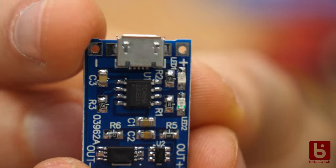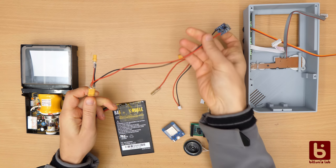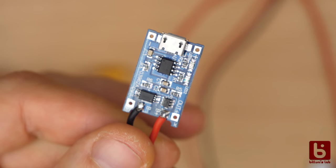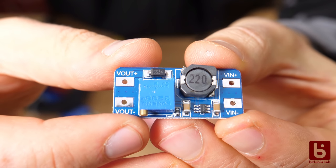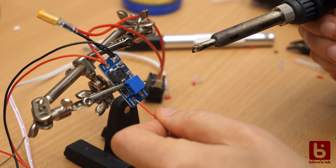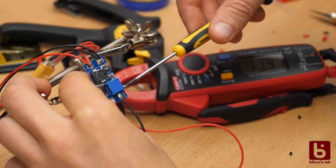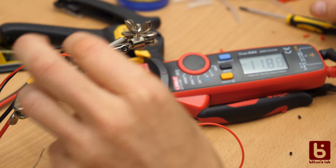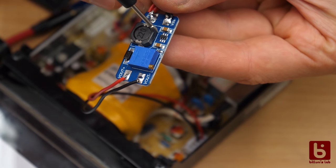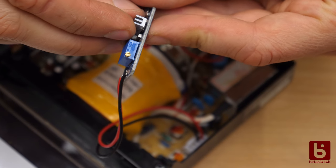A new addition is this off-the-shelf charging circuit. It's connected to the battery directly and is able to charge it with 1 amp from USB. To get the 12 volts for the CRT I have used a step-up converter. It has to manage at least 2 amps since we have to step up from 3.7 volts to around 12. Even though the seller stated 3 amps, the small IC on the board got really hot so I added a small heatsink.